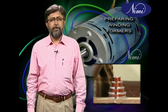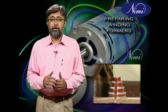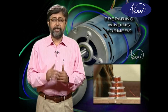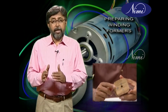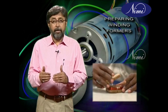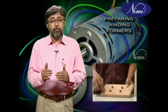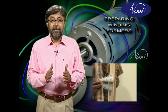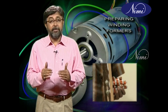In this exercise, we learned to make formers for winding different types of coils and also learned to wind coils using them. First, we made a former for diamond-shaped coils and wound a coil using it. Next, we made a former for skein winding and also wound a coil. Then finally, we made a former for concentric coils and wound coils using it.